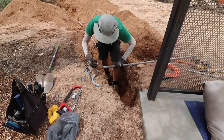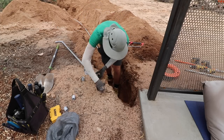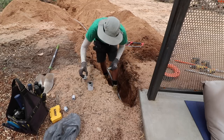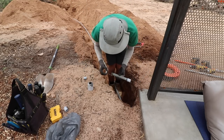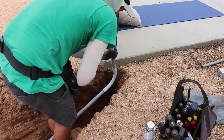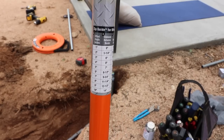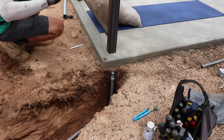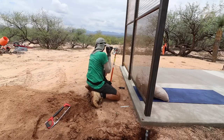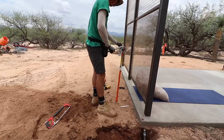I've made my way all the way to the pergola and I'm just gluing a 90 onto the end of the PVC pipe — always buy PVC 90s, don't try to bend one with a heat gun. On the end of that 90 I'm gluing a slip-connection to a three-quarter-inch threaded connector, then screwing in a three-quarter-inch rain-tight EMT connector. On my conduit bender there's a guide for doing offsets — I need a five-inch offset, so I'm bending two 45-degree bends seven inches apart, then adjusting the pipe against the pergola until it looks right.